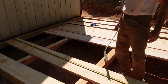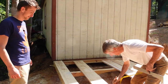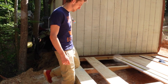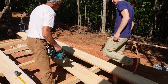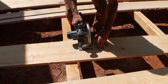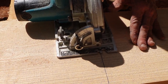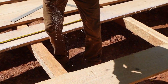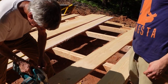We want to make sure that cut is right because if it's not, the butt joint will be ugly. I don't like an ugly butt joint either. We're going to go one and one. So you make it a puzzle - you want to measure, you want to cut. The best way to do this is to set that piece right there on the line, see that, and then look down here at the blade, see where it's going to hit. It's already binding. Why is it binding?